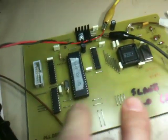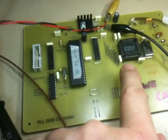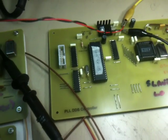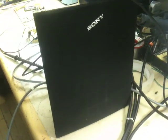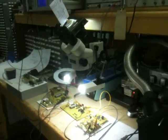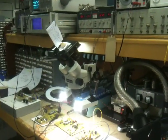This ensures that the two DDSs — master and slave, transmitter and receiver respectively — keep in step. You can actually hear at the moment: we've got the output from the receiver going to an LM380 2W audio amplifier fed into a speaker. The click you can hear is caused by the step change. This is only a prototype at the moment, and we can find ways of improving that later on.